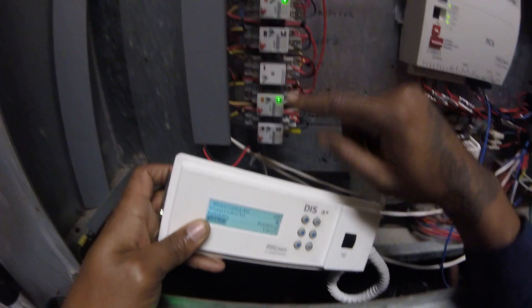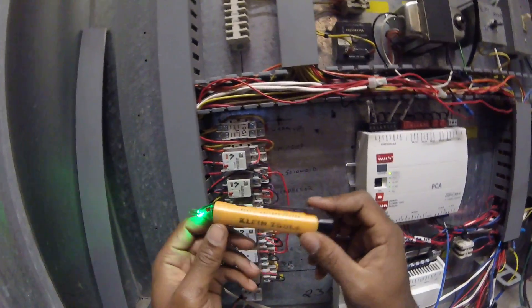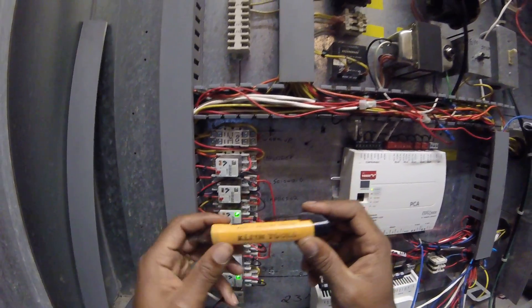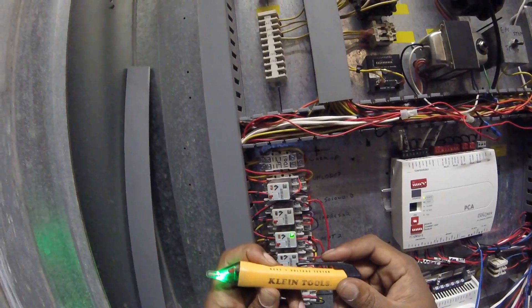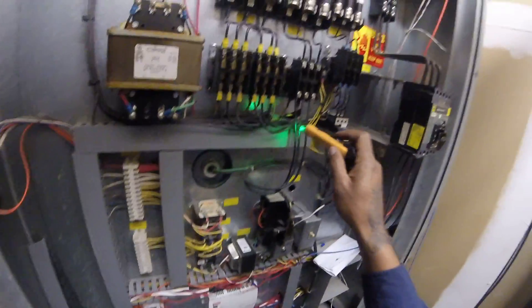See, when I just called for the blower, that relay kicked in. I don't know exactly how much these cost, but I know they sell them at Home Depot. I always keep one of these with you — it will save you a lot of time before pulling out your meter just to make sure you got voltage.